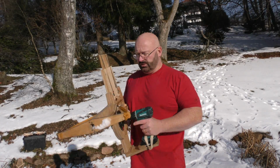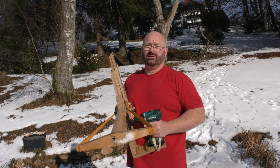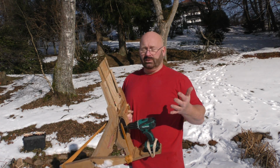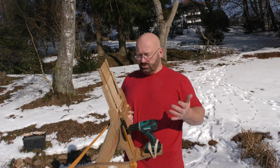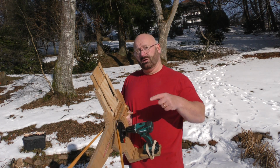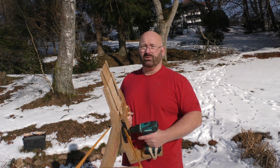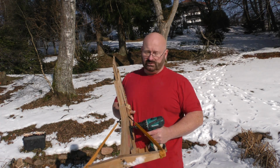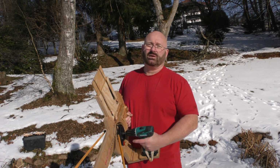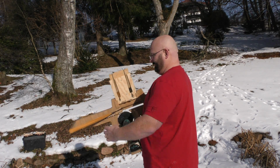Many people also suggest why not use a normal DC motor for this. Well, the problem is that these DC motors usually don't have the torque. They're all speed. The same is true for angle grinders or chainsaws. What I need is a transmission that has high torque, but not that high speed. And these drills are ideally suited for that. It will be very hard to find something that beats a 15 Newton meter, 300 rounds per minute Makita drill. And it's so much fun. Oops.